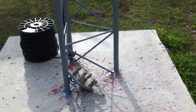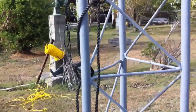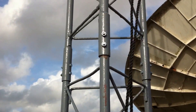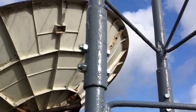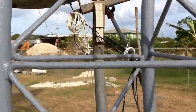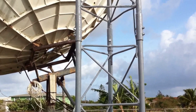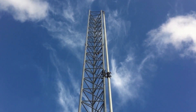We are going slowly but surely into the completion stage. Still have the rope — as you can see it is joined by these double bolts. Very sturdy, very strong tower. These are inch-and-a-quarter pipes with seven-sixteenths zigzag braces from top to bottom. This afternoon we'll get back to it and put the other section up.